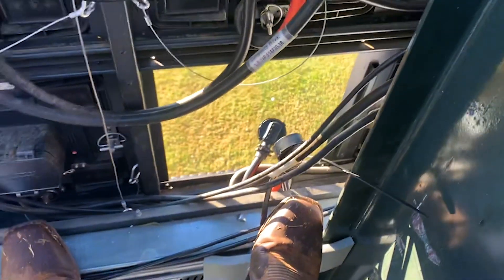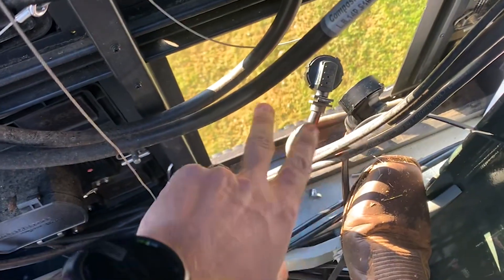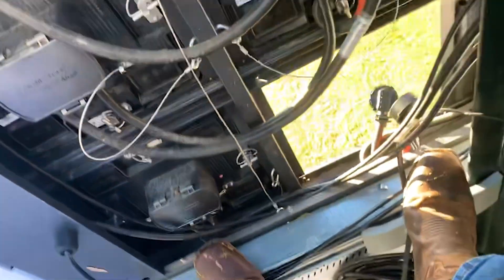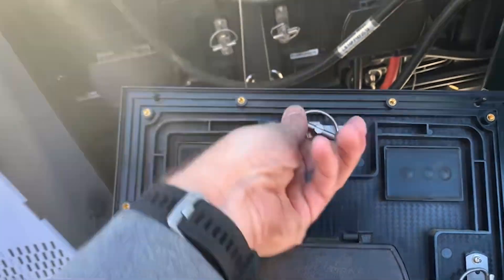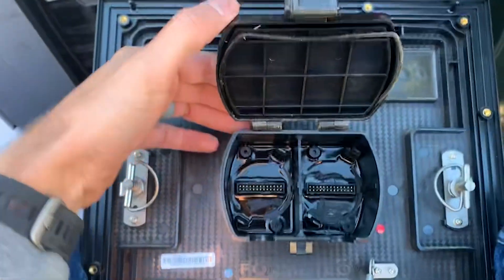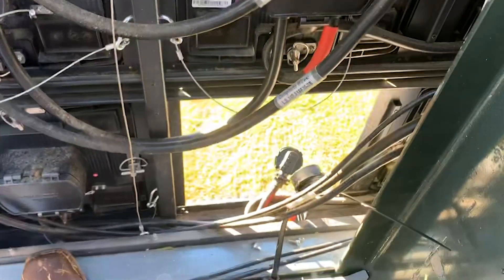I got the tile out. I know it looks like a lot of cables but it's really just these two right here hooking to the back of the tiles. To get a tile all the way out, all you do is just turn these - they just lock in there, and there are four of them. Just turn those, then unhook the two cables and it'll pop right out. Turn it sideways and bring it back through the hole - that's all there is to it.